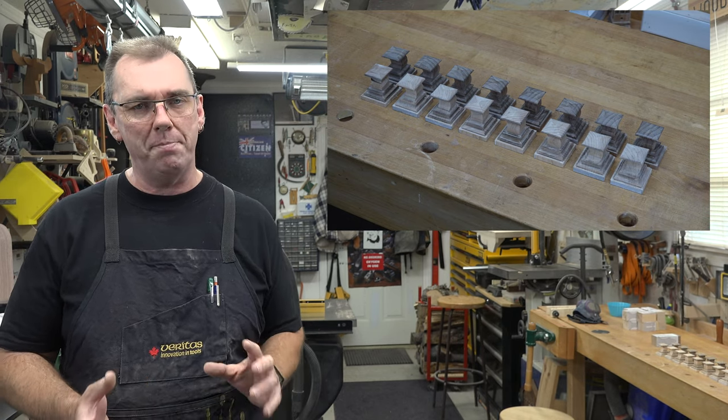All right, so I've got all four knights cut on both of their sides that you need to cut them. And let me just break them out of their casing here and see what we've got. There we go. And you can see that, well, they're kind of horse-like, but this is really chunky, and this is where we want to concentrate on next. Now, I'll show you here on a maple one so that the lines show up. What you want to do is you want to draw a line from this point here, where the jaw meets the neck, straight up, just like that, right up to the top. And you'll do that on both sides.